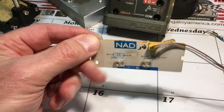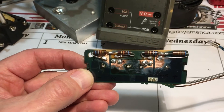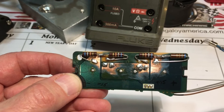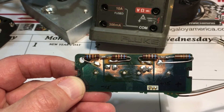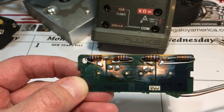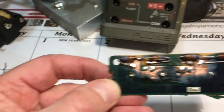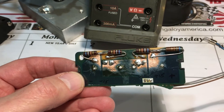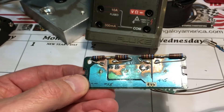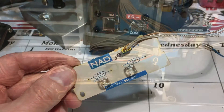Here's the finished product — looks great on one side. Prepare to be astounded on the other side — yes, that's a ridiculous number of resistors for just a couple of LEDs, but it's what I had in the junk box. Those are 680 ohms each in series, so we're hitting about 1.4K total — we were aiming at 1.5K. Power handling is fine since those are each half-watt. I sanded off the coating so I could solder — this is going to be a nice blue glow.